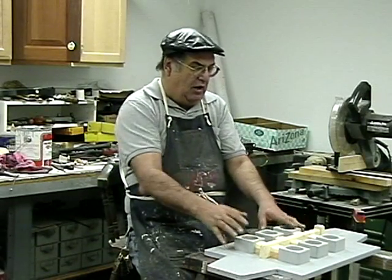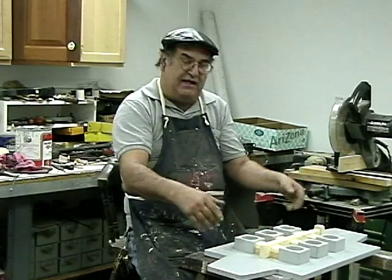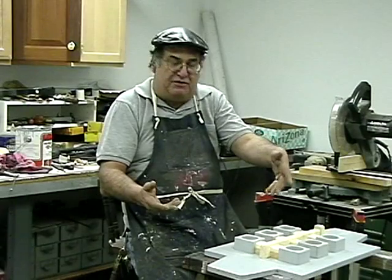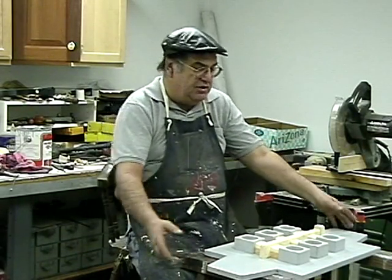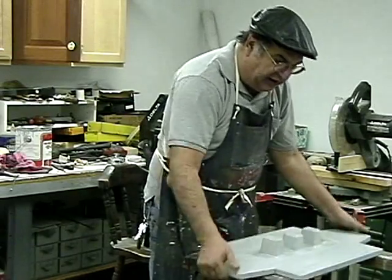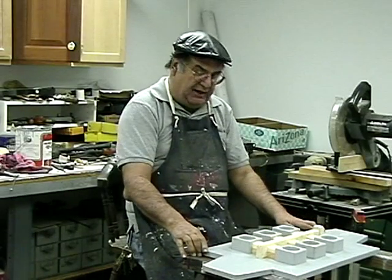Now you can say, well, how would it be cheaper if I put 20 of these on a board? No, it wouldn't, because now you got a mold that's huge and guys need a crane to lift it, or it is a time issue. So one man can run this. In other words, he molds it up, flips it over, molds this side, and he can handle this.